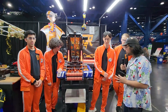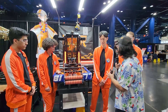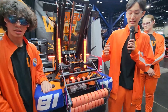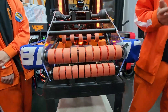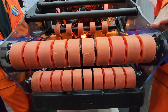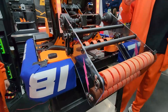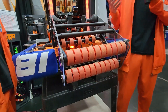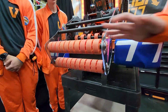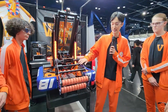Roland, talk about your intake and your wrist — it seems really small but able to handle all the game pieces. So for this year we wanted to keep our intake pretty simple and intake both pieces — both a cone and a cube. We went with a triple roller design with the front two rollers for the cone and the bottom two rollers for the cube. At the start of the season we got inspired by Open Alliance team Spectrum 3847 with their dual roller prototype, and we expanded upon that to use it for both cones and cubes, continuing to iterate to get this final intake.